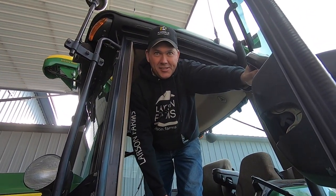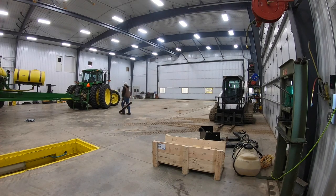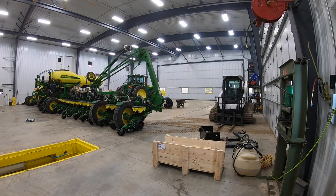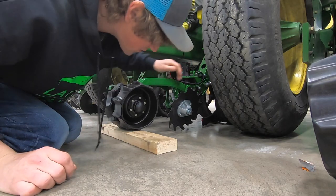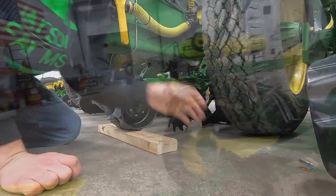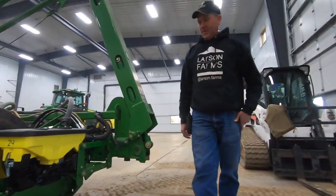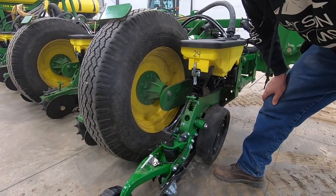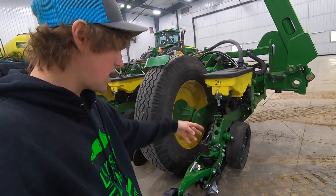Tires are going to get muddy. We've never used anything like this closing system before, so we really don't know all the fine-tuned settings needed. The theory behind it is something to do with lifting the soil beside the trench so the seed can be packed in better - or more specifically, crushing the sidewalls of the V that the opener makes.